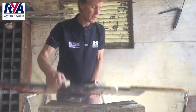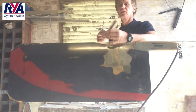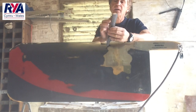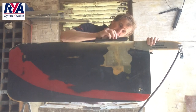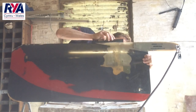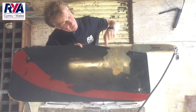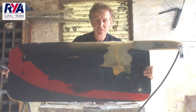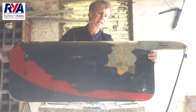This is where you've really got to be careful. Use a longer block — there's a reason for that. A longer block, with the 120 sandpaper put nicely over it, and here I'm working down on the top of the edge, middle of the sanding block — not at the edge, in the middle. Carefully just sanding that down. A big block means you don't hollow out this trailing edge, so take your time. You can see this side is really quite flush where the tape was — just a little bump still, but coming down nicely.